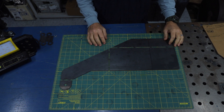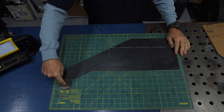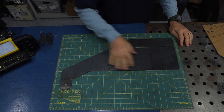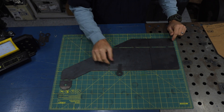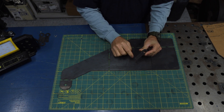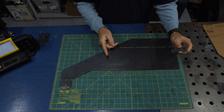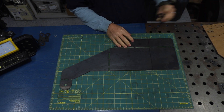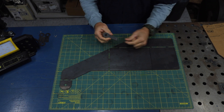Here we have a piece of steel with slots for bending. This hole is to mount straight to one of our motor mounts, but as you can see there doesn't seem to be any other mounting point — that's what this secondary bracket is for. It has a place for mounting and a little shaft that we'll put a piece of tube steel onto. We can cut it to whatever length we need, and then the other end of the tube steel will go to the plate and mount somewhere for more rigidity. So we've got to go get some tube steel.